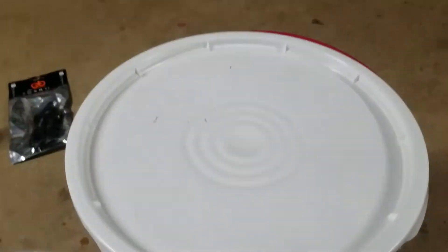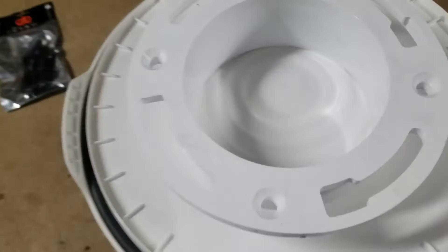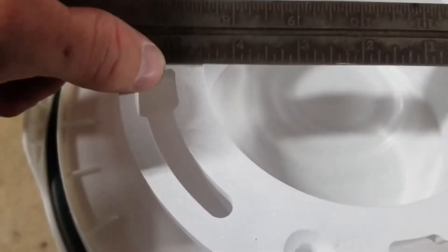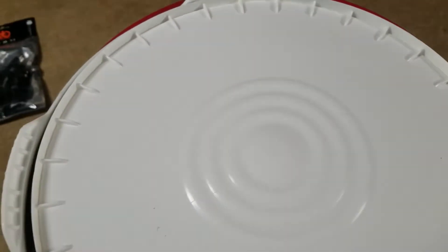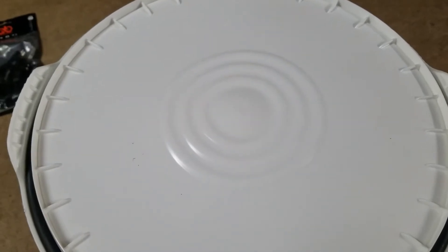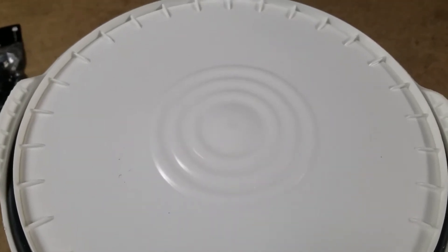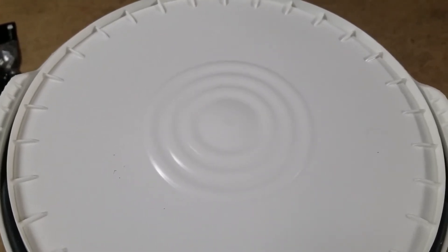I just want the flange to go roughly in the center of the lid. I'm going to put a little dimple right there for my compass. The inside of the flange rolls out to about four and a half inches, so I'm going to set my compass up, use the little dimple, and mark out a four and a half inch hole. I may or may not cut that tonight - may save it for tomorrow. I'll check if my grandpa has a four and a half inch hole saw; if not I'll just use my jigsaw. Then we can move on to the fan.